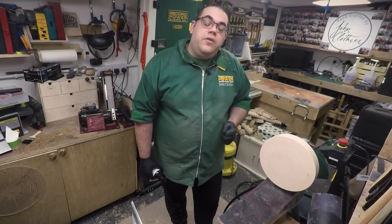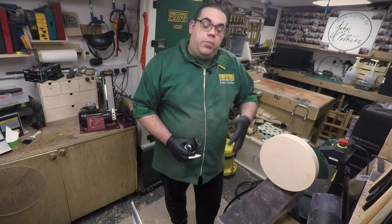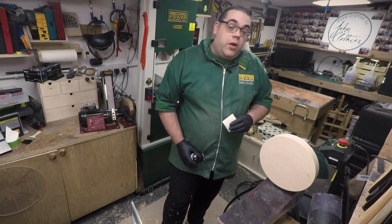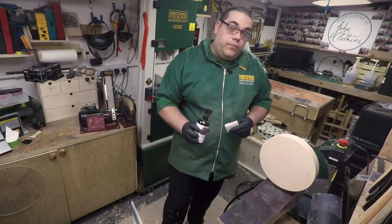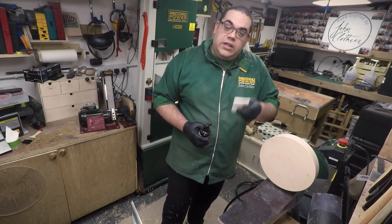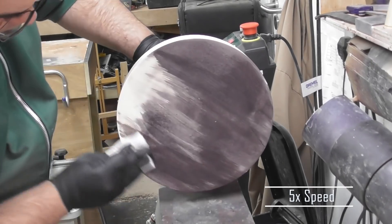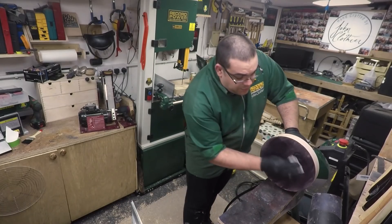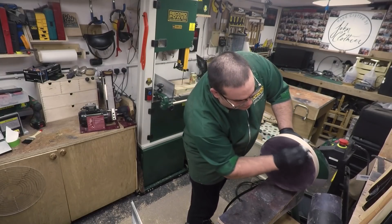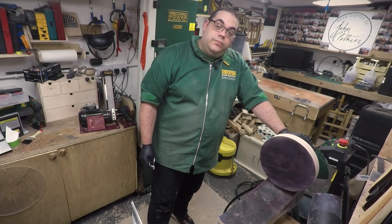Okay, so that's all the blue gone — now let me show you the next technique. What we're going to start to do now is layering colour. The easiest way to start off with that is by applying a dark colour to the wood, then removing a lot of it but leaving some behind, and then applying a top colour. So I'm going to start by applying a darker colour and for that I'm going to go with black. Once again I've got the board down, got my gloves on, the wood's been sanded to 400 and I've cleaned it. I've got my kitchen towel folded into a neat little pad and I'm going to apply the black. The black is applied in exactly the same way as we did the blue — little circles. Try not to put too much colour down in one place; try and get it even, but actually if you don't get it even it's not the end of the world and you'll see why in a second.